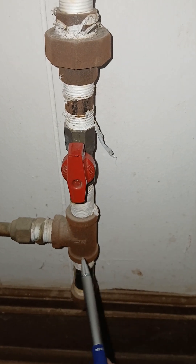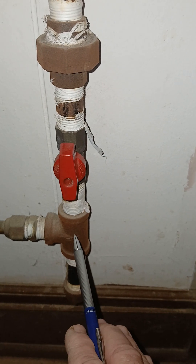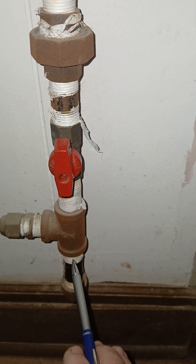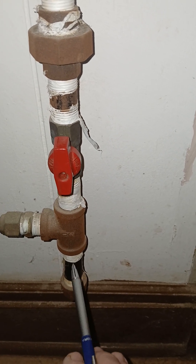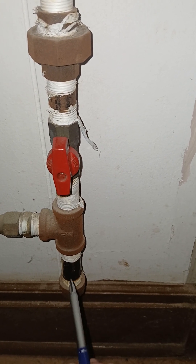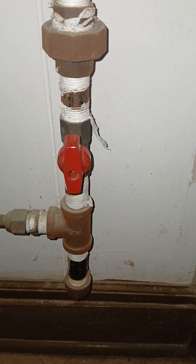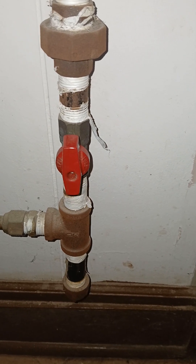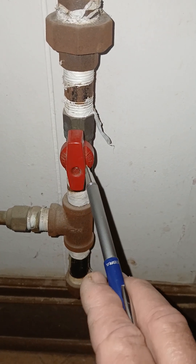When putting this in, you have your incoming gas line, a T fitting, and a sediment trap. Hopefully any water, small debris, or similar matter falls down into this sediment leg or sediment trap.